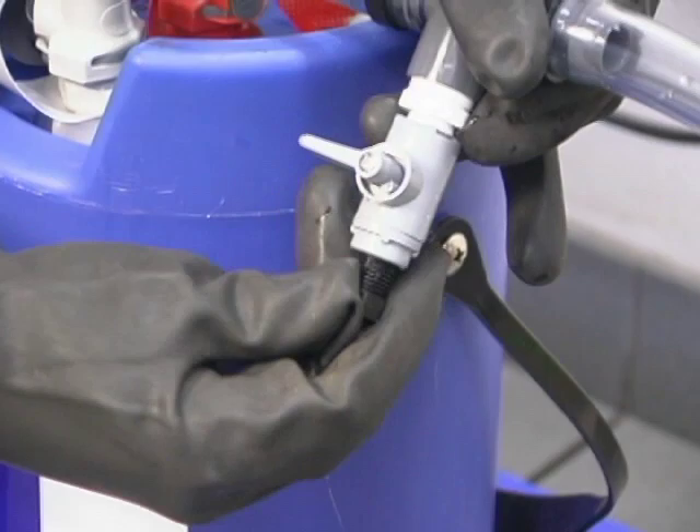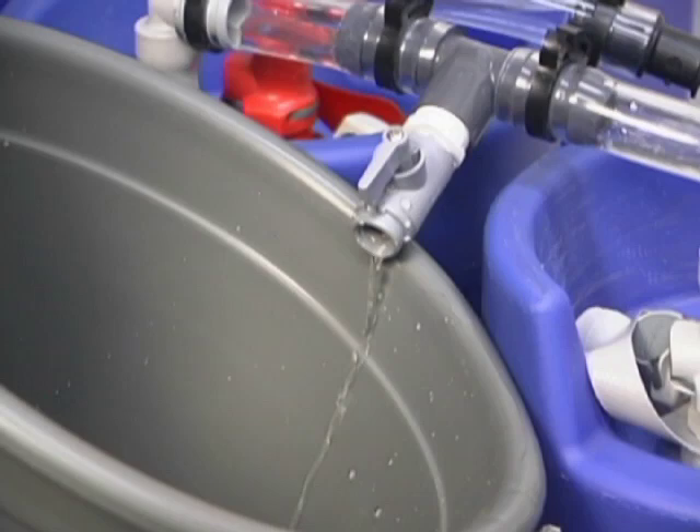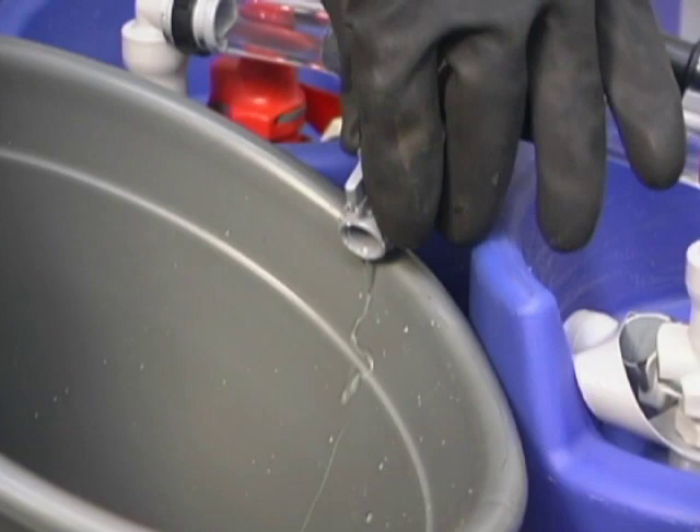Using a large container, turn the lever vertical to open the gray sample valve. The liquid in the hose will be released into the container. There may be pressure on these valves — always open them slowly and point the valve away from you.